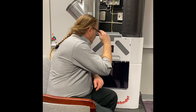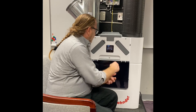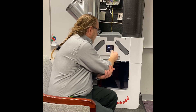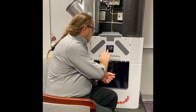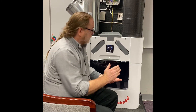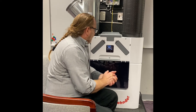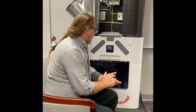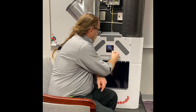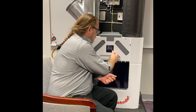On preset two for the 600, it's picking 400. Preset three is 540. Preset one is 280. And away mode is 120 — I'm just confirming all of those. It's going to ask commissioning airflow in which speed. We're going to pick speed two because that's the speed the unit runs on 24/7. Confirm. Now it says to go ahead and fine tune all the supply and extract valves. I'm going to confirm this as if I've done it already. Then it questions — are we sure that they're all fine tuned? Yes. Confirm.